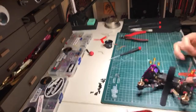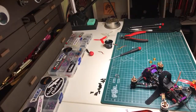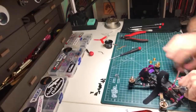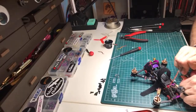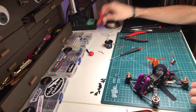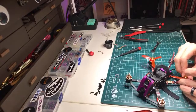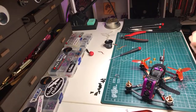And then, yeah, the packaging of the frame just really works. The flight controller sits up in the front, which I really like, so you can drop it down on 20mm standoffs really, really easily. You get to run your camera output straight down to the flight controller, and then the VTX out can go just straight out the back under the ESC, nice and far away from the motor wires. A lot of little things. The stack bolts are fully isolated from the bolts going through the arms. The two front arms connect.